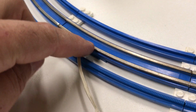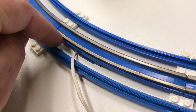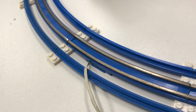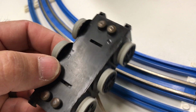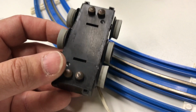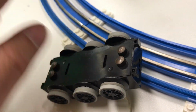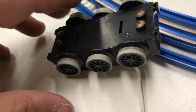So each rail, you need two conductors to complete the circuit, and this side can never touch that side. If you do, you'll get a short circuit. So these two rails send the electricity to the motor, and there are different varieties of the motors, but it needs some kind of contacts, and usually two to have continuity in case you go over a dead spot. One will always be touching. So there's two conductors, these little things here, and the reason they're springy is so that when there's unevenness in the track, they will still touch the conducting rail.